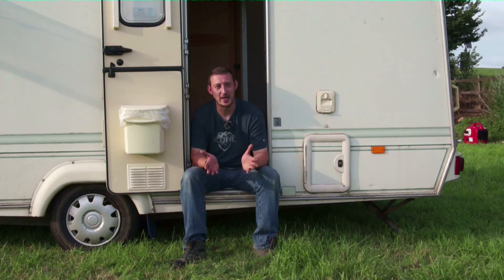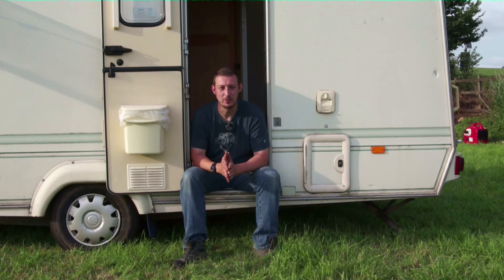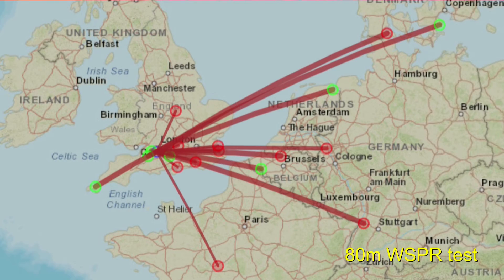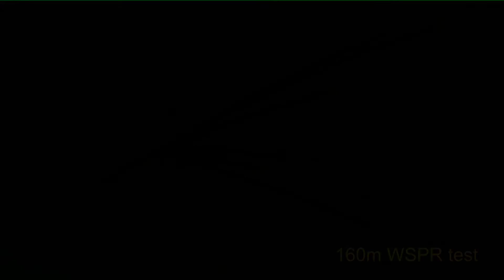Conclusion time then — terminated inverted U scaled up, did it work? The long and short answer is, well, no, if I'm honest. Not a total surprise and I'll explain why in a second. I've had a chance to get it on air and tried a couple of SSB contacts and also done a little bit of WSPR testing. I'll show you the plots for 40, 80 and 160. The plot for 160 leaves a little bit to be desired. On 40 it looks like it's working but it's not great — I tried to make a couple of SSB contacts and my signal was way down. I made the contacts but the signal was way down. On 80 I didn't make any contacts whatsoever. A few stations picked up on WSPR but nothing on SSB, and 160 was frankly a complete and utter flop.